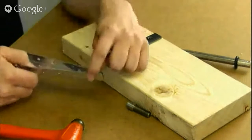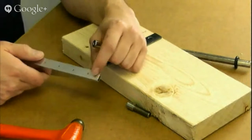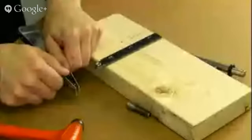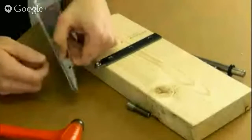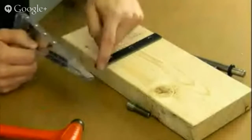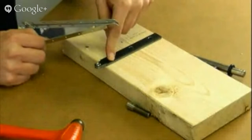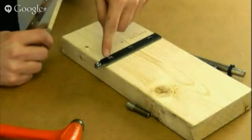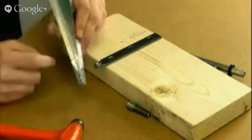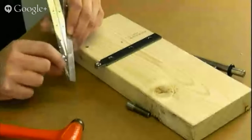That is how you use the tight fit dimple fixture to get into those last holes on the rib. The old way — which has been Van's advice for years — is to actually bend the flanges open, dimple them, and then bend them back square again. I'm not a fan of that technique, which is why we came up with this. The only other competing tool would be vice grips with dimple dies welded on the end.